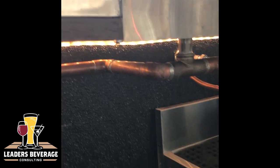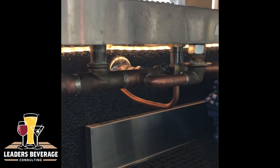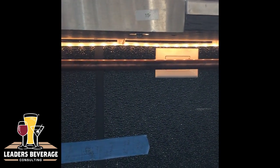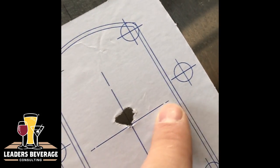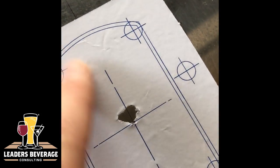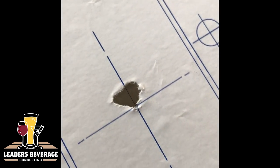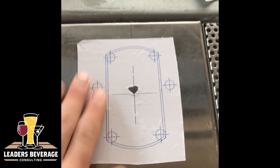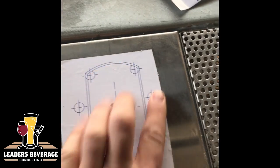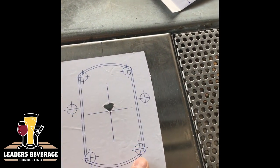Something not to forget is that you have space to mount underneath. A lot of times you'll end up with plumbing works that might be in the way, so that's something to consider and remember. What I do is tear out a little bit of hole, and then I'm able to match up the crosshairs with the crosshairs I drew in with pen or pencil. And that way I know I have an exactly perfect, even position. The fact that this is a sticker is phenomenal because it just stays right in place and we're able to easily make our first guide holes.